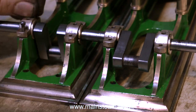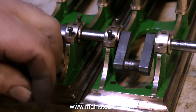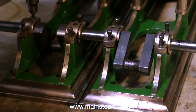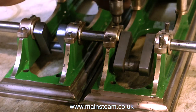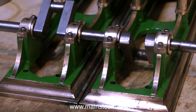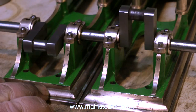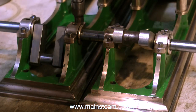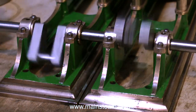At the moment, running at a higher speed than normal, is the fitting of the top caps. I put each bolt into the top cap and give it a quick twist to seat it into the thread, and then using the socket on a simple screwdriver handle I tighten up the bolts and give the crankshaft a quick spin. It's running very freely at the moment but the bolts are not very tight, so I add a little bit of machine oil and tighten the bolts further. You really must be very careful doing this — it's not a good idea to shear off any of these bolts.